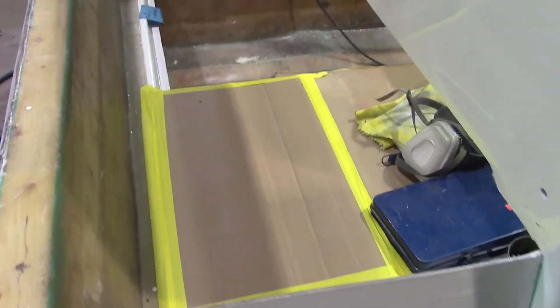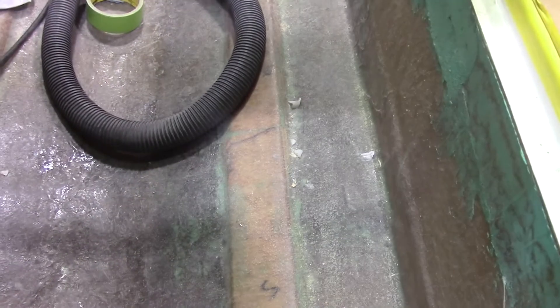There's a lot of glassing and fairing involved — all that green is the filler. Once the hulls are joined we glass it in a number of spots, as you can see it's glassed right through there. This extension actually overlaps, which is why there's a bump. The overlap is screwed together and pasted.